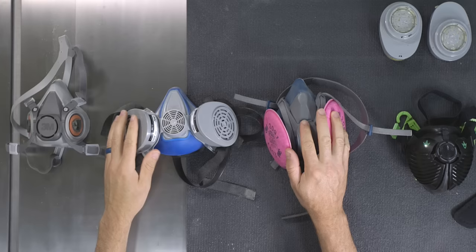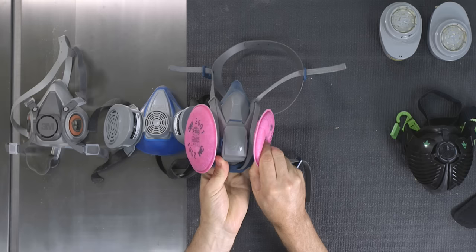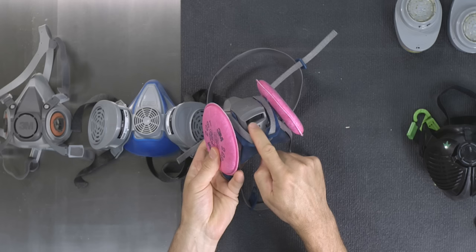The majority of the masks and filters covered in this video are more than adequate for most woodworkers. Finding the one that fits best really comes down to trial and error. I personally always have at least two masks — I use my MSA mask set up for organic vapors, and I use my 3M 6503 QL setup with a P100 filter for all of my woodworking. Out of all my masks, I use the 6503 the most because it's lightweight, it seals 100% to my face, it's easy to breathe through, and the exhaust vent points down, which is extremely helpful.